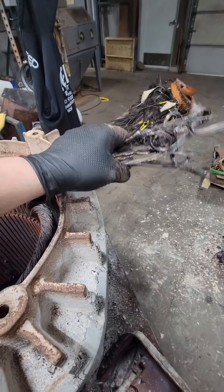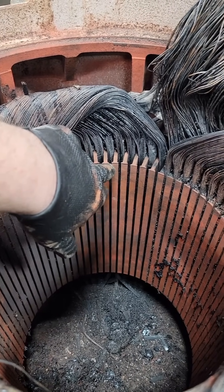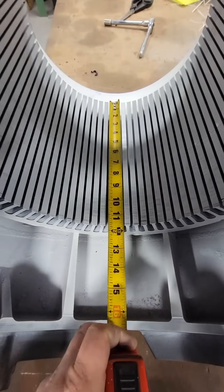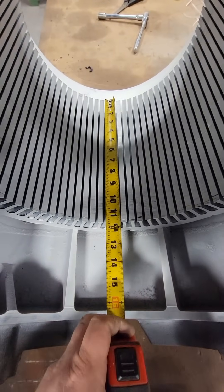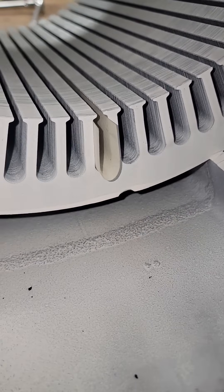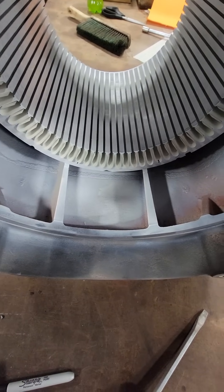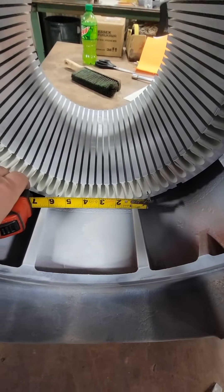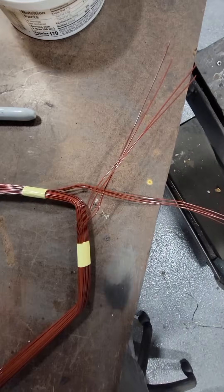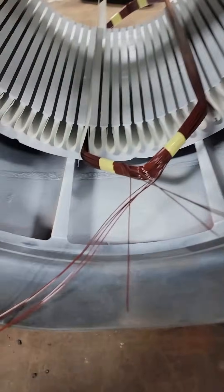We have basically separated the winding into two separate circuits — or halves or parts — part winding start. Another misconception is that we're doing the same thing, trying to get it up to speed, however that's not the case. What we're actually doing is energizing half the winding, which will take half the current and produce half the torque. We aren't trying to rotate anything; this process happens quickly. What we are trying to do is basically put the load on the line to alert the power company that we're about to energize this motor and we need more power, and this can be adjusted in just a few cycles of your hertz. It's not uncommon that during that part winding start sequence we don't get any rotation out of the motor at all — we're not trying to rotate it, we're just trying to draw current.